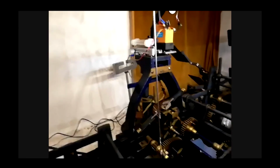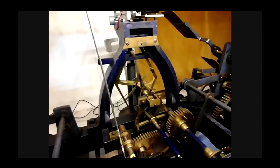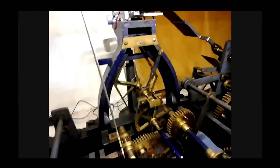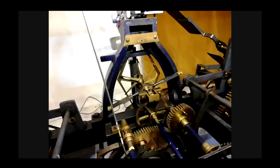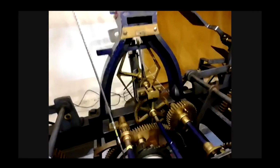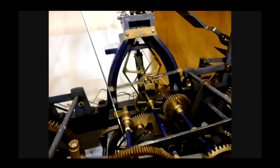So you're absolutely right. The weights make the bells ring faster if you make them heavier. But the one that doesn't make any difference at all is the one for the going, the littlest weight. And that's because of this very clever escapement. It's called the double 3-legged gravity escapement. And that's that pair of lozenge-shaped things here. It was invented in the 1830s, 1840s, especially for the clock at Westminster, the one where Big Ben is. Now, I could explain how the double 3-legged gravity escapement works, but if you go to that website, you'll see a lovely animation of it.